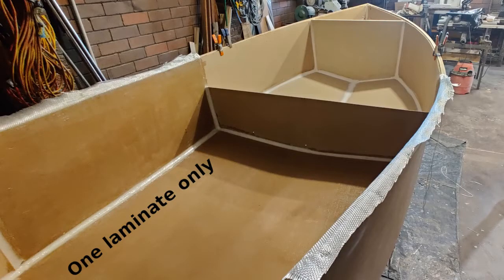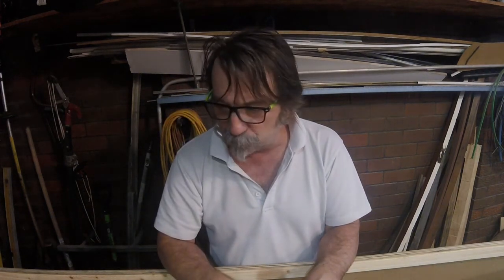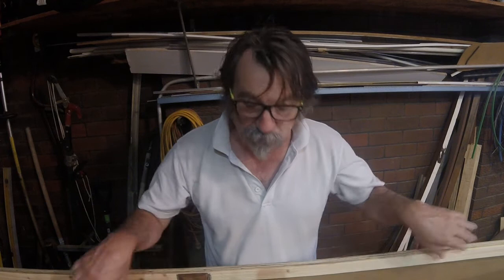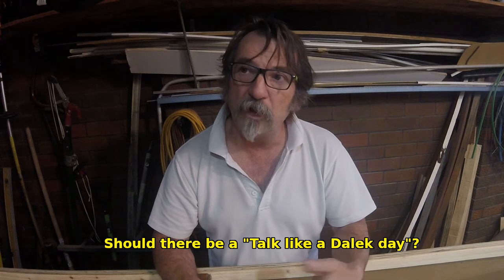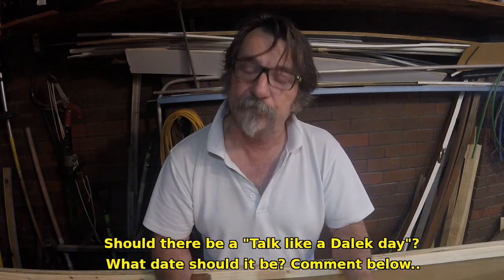The other thing I haven't done is put a second layer on the bottom of the cockpit. It does flex a little bit — nothing like the fiberglass dinghy we used to have — but I have a feeling another layer wouldn't hurt, or maybe some stiffening strakes: little 10 by 10 rounded-off ribs running down either side of the centerline for about a meter and a half with fiberglass over them. But I'm not going to do that — if we over-engineer it and it works, we don't know what the minimum is. So I'll leave them out, and if it doesn't work I'll fix it.